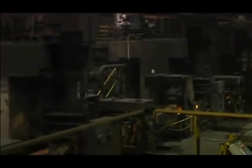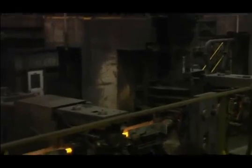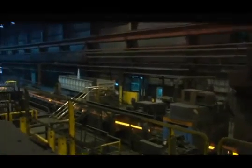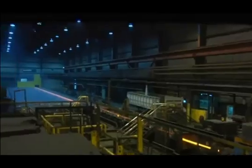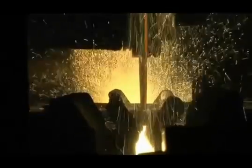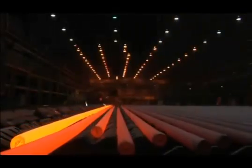At the Harrison Steel Plant, after the cast blooms have been reduced on one of the large mills, most of them are processed on our 10-stand inline horizontal vertical mill. The bars are rolled to the precise size, desired surface, and texture specifications. After rolling, the billets are cut to the desired length and transferred to the hotbed for controlled cooling.